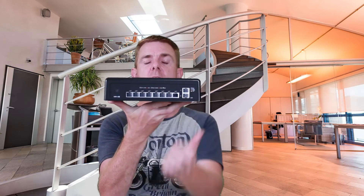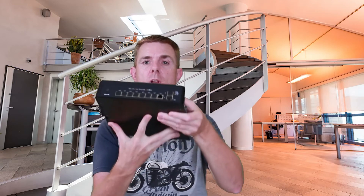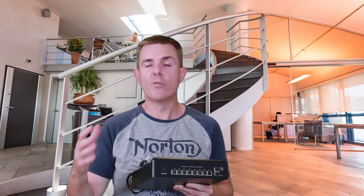These two on the side here are just standard Ethernet ports, so that makes 10 ports in total, and you've got your small reset switch down the side here. This is managed by the UniFi controller. It's plenum rated, it's designed to go in roof voids, wall voids depending on the size, in a container, or in restricted air flow spaces.